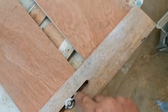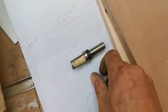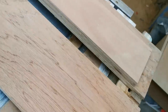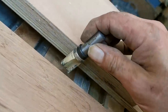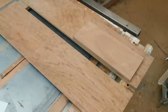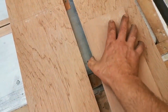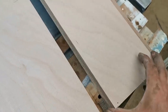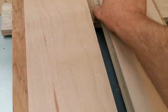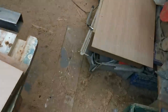It takes time to make these, cut these grooves. So I'm going to use this cutter. I reckon if I stick a piece of 18mm on there, that should run okay. Got loads of scrap, so just glue it on, get it as close as I can. So I've cut a couple of pieces of 18mm, and I've offered them up against there, and that is still a very straight, clean cut. So I'm going to glue and staple that on.